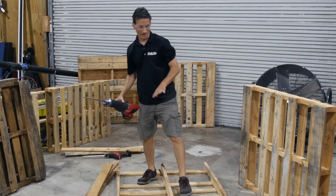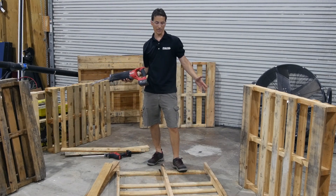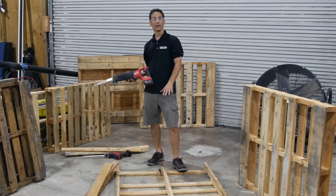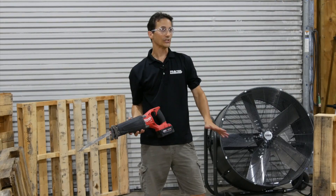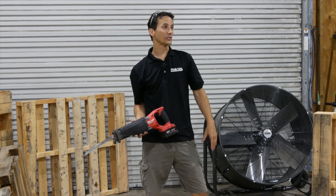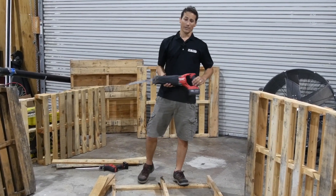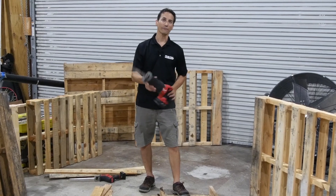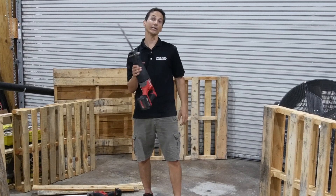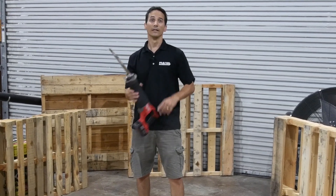I think you get the idea. We just took that pallet down in a remarkably short amount of time. You're probably not going to use the stringers — you'll just use the pallet wood from the top and bottom. This is absolutely the fastest method to take the pallet apart and get those boards to use. I did it with a Milwaukee Fuel Sawzall, but you could do it with any full-size Sawzall — corded or cordless. I prefer cordless for the flexibility. Get that long blade, and if you can get a carbide tip blade like the Milwaukee Axe carbide or something similar, that's really going to help you out.